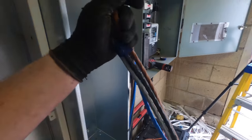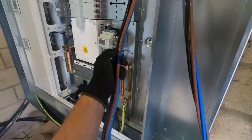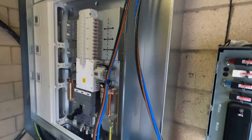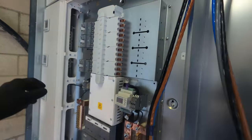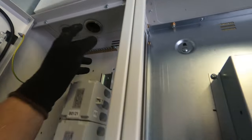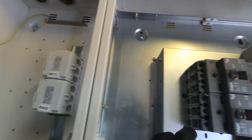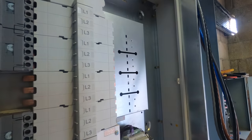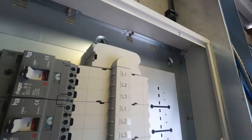Right, so these aren't long enough, like I say, to be taken round. We've got loads of repair to do. None of this was us, to be fair. They're going to get sent through here. So I didn't have these bushes, but I'm going to get the two that I put in up here because we can do this bit tomorrow. And then at least I can get these feeds through and get them made off. And we're still moving then, and then I can just leave this little isolator. That's just an in and out from a breaker and that cable that Cam's doing, so that one can just get left out, but these can actually get put away and we start moving on them. So I'm going to do that now, bosh two holes through there, nick these, and then yeah, happy days.